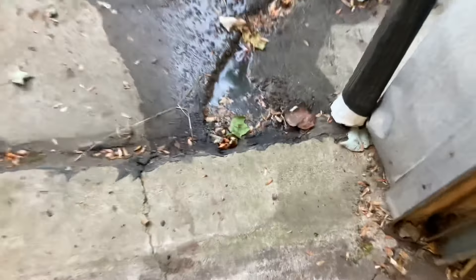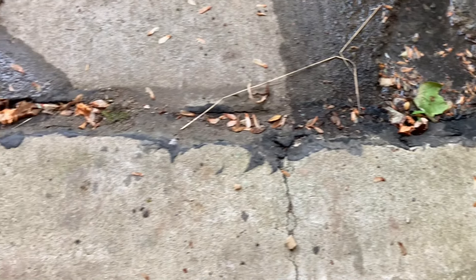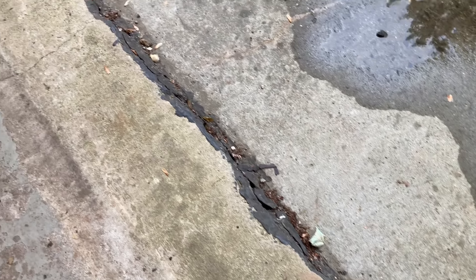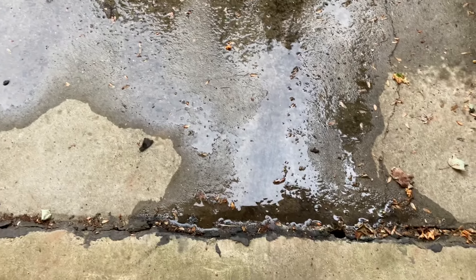This whole thing was built by the previous owner who's been dead 15 years. See this crack? It was big enough to fit my hand down there when I moved in. I tried filling it with sand and crack sealer, but Pennsylvania freeze-thaw cycles just laughed in my face, and I suspect the water has been rushing down under the slab and eroding my base.